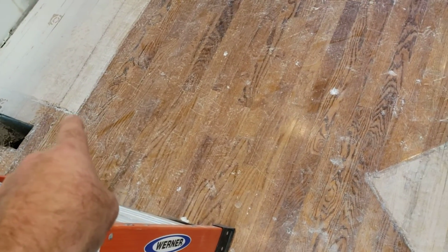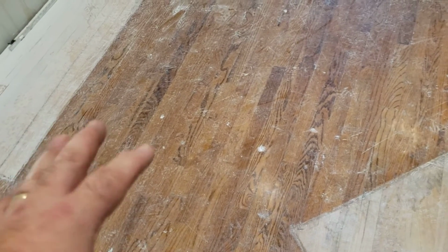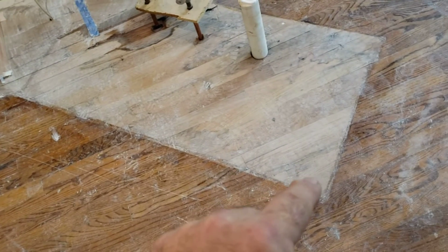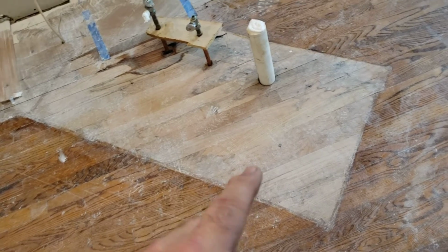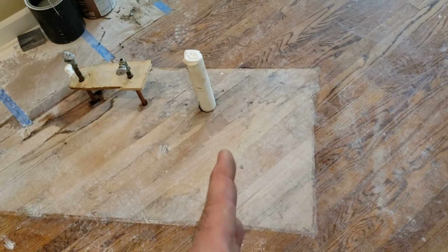The other thing was in the original kitchen, and from this corner of the cabinets to here is about 42. Of course, this is the toe kick, which is only 21 inches deep. The original cabinets were probably around 36 to 39 inches wide here, and that's still fine. ADA compliant is 36, so we should be good as far as that goes. But one thing I did notice here is that this toe area is 48 inches long, which would have been 45 inches of face frame. So the original cabinets would have had about a 9-inch or a 6-inch cabinet right here at the end.